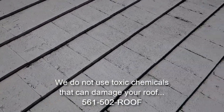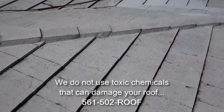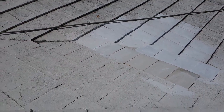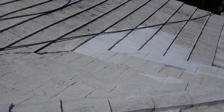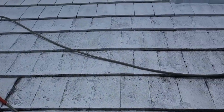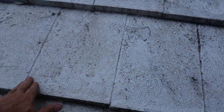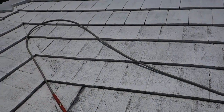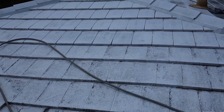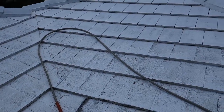There's a lot of loose paint, and we're going to use high pressure on this roof with high water volume today. We had a little roof leak in the corner — we fixed that, and it's been confirmed fixed through several rainstorms. There's also an option where we can fill these joints with patching compound and waterproof the entire roof, as well as putting our hurricane sealer on. You can look at one of our other videos on that process — we put the hurricane sealer on first and add it into the paint so it binds onto the surface with the same polymers.